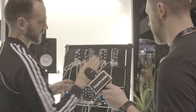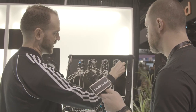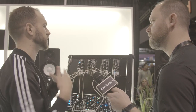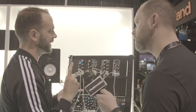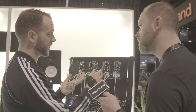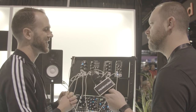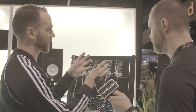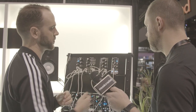There are two outputs — they can be identical, inverted, or interact in a couple of other unique ways depending on the mode. They each have an attenuator that goes from zero to ten volts, so you can use it for VCAs, filters, or anything. It can be ASR, AD, ADSR, or a bouncy ball mode — the classic bouncy ball patch that mimics gravity on a ball, speeding up and slowing down. That's built right in and you can access it with the cycling mode.